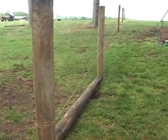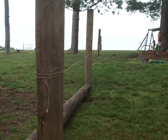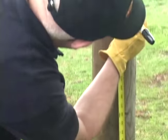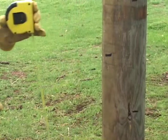We then mark the post for the rail or horizontal brace post location at 42 inches, halfway between the top two wires. Another end post has been driven at the opposing end of the fence line. A tight string line has been run 24 inches off the ground, allowing for post alignment as other posts are installed along the fence line. Now mark the brace post for your insulators at 24 inches, 36 inches, and 48 inches, and mark the brace post at 42 inches for the brace rail.